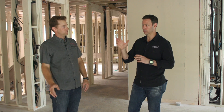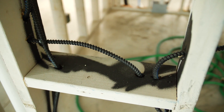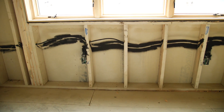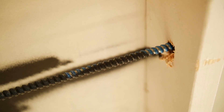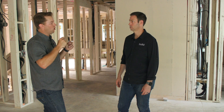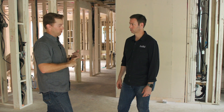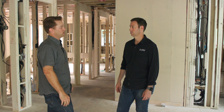I'm seeing metal cables and some black paint — I don't normally see that in a residential job. The client had some EMF concerns, and the consultant recommended armored shielded Romex. It's very common in commercial, but essentially it's a metal coating coil that all the Romex goes through. And then the black paint is a paint combined with graphite and cobalt, which helps shield magnetic frequencies coming out of our 110 power in our homes.